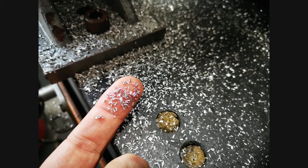On the second and third try I did get a nice cut with cutting depths of five and ten mils respectively, but I did get the sparks that one often sees in hard milling. So again I find myself considering the need for a lube or cooling system. I did build a fog buster clone years ago — maybe I'll install it here.